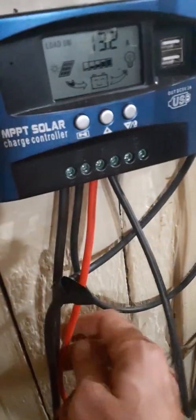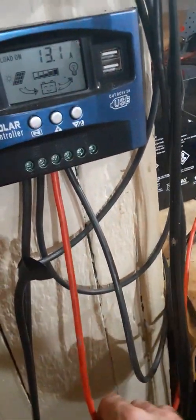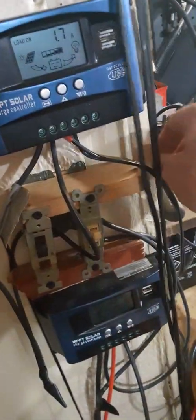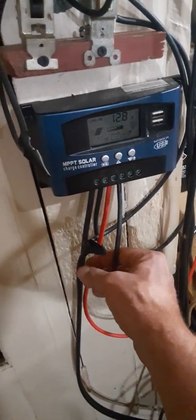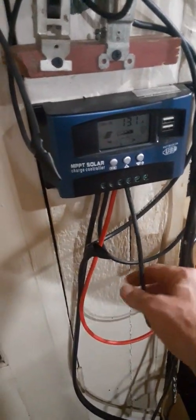You want this big thick wire rated for 30 amps. I've literally had wire burn up — it wasn't rated. On the Thunderbolt solar you're only running 1.7 amps so you can use lighter wire, but on 400 watts you're running some amperage — up to 20 or 30 amps — so you want this thicker wire.